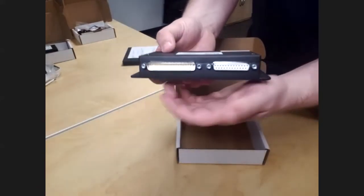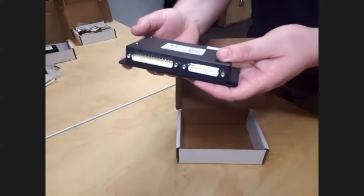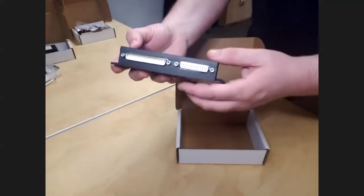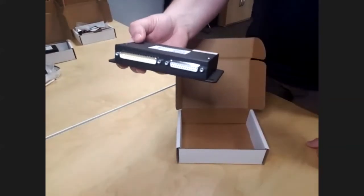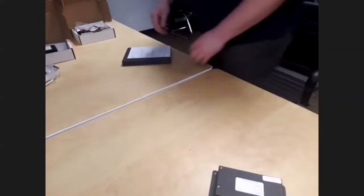This goes to things like RPM, voltage, oil temperature and pressure, fuel tanks, and so on. The second plug over here is a 25-pin, and these are opposite genders to further make them distinct from one another. This connector is what's going to all of your thermocouples for EGT and CHT detecting. So, talking about CHTs and EGTs, let's get some in the field.